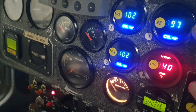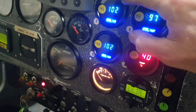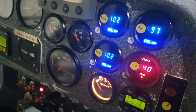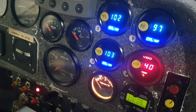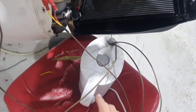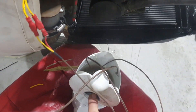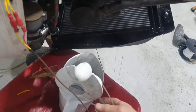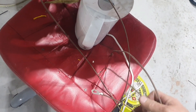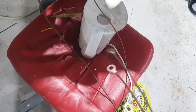This one normally hits 98, this one typically 102, and this one normally 103 — so a degree or two of variation, but pretty accurate. And this one right on 100. You can see she's boiling alright. And there are the three thermocouples that'll go under the spark plug.